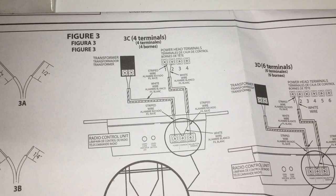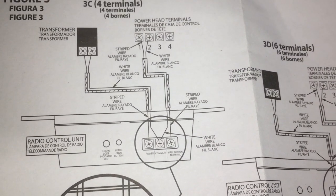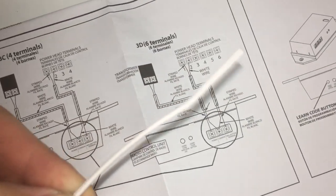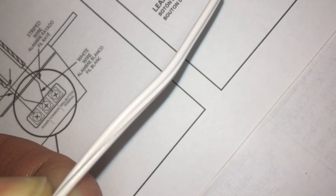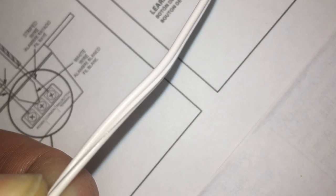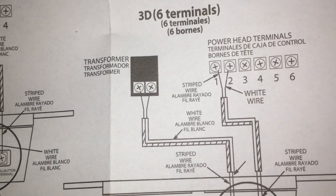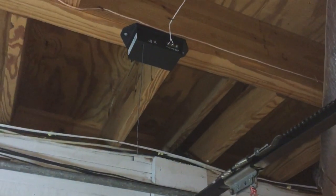Here's your wiring diagram — it shows the power transformer with the striped wire as the power wire and the unstriped wire as the common from the transformer. What you receive may look a little different; on mine there's a really light gray line that's hard to see, but that's the stripe. So that'll be your positive and the other will be your negative. Make sure you hook it up correctly on the transformer — positive on the left screw and common on the right.